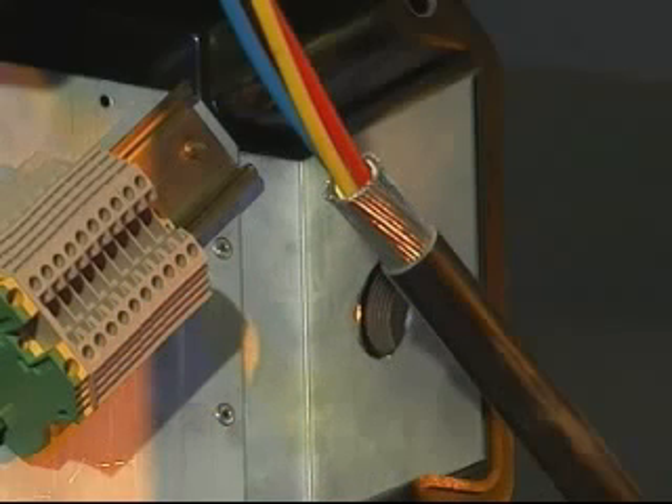Cable preparation — ICG 653 Universal, ICG 653 Dedicated Armour and ICG 623. Allow sufficient length of cable to enable termination of the conductors into the junction box. Strip back and remove the required amount of cable sheath and armour or braid to enable connection to the terminals. Remove the inner sheath level with the armour or braid to expose the conductors.